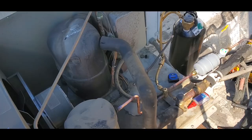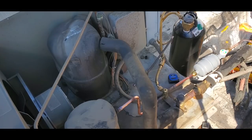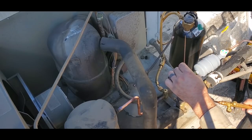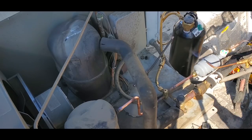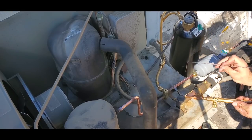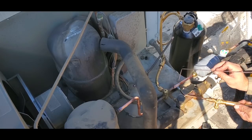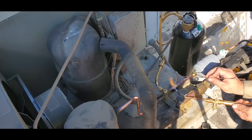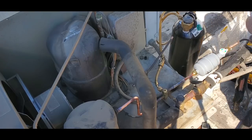I'm going to clean up my messes a little bit. I'm using 15% Silfos. I'm actually using the solder weld round rods. They're pretty nice. So I have the power on, the solenoid valve's still open downstairs, so the nitrogen has a place to go. It moved on me, but it's okay. It's still there.